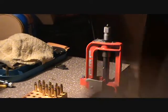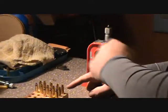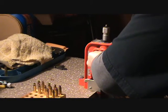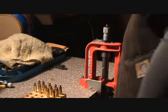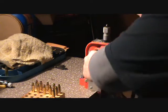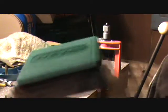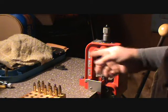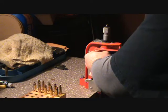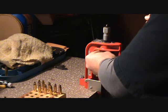I think Dillon makes one that's a whole lot easier — it's got just a little lever, you put the brass on, flip it down, and a handle that you just pull down — do it really fast, no problem. Like I said, once you get used to this it's not at all difficult. You can use a universal decapper or the RCBS swage tool. For the price — I don't think I paid maybe twenty-five to thirty dollars for it — get it at Midway. The majority of stuff I use is Lee, but Lee, that I know of, doesn't make a primer pocket swager.